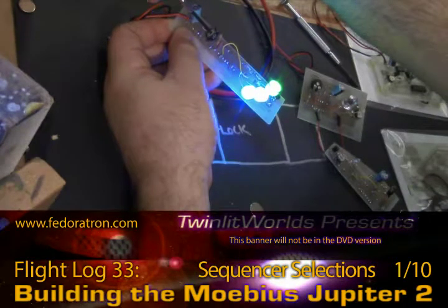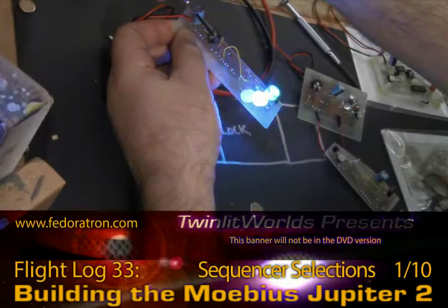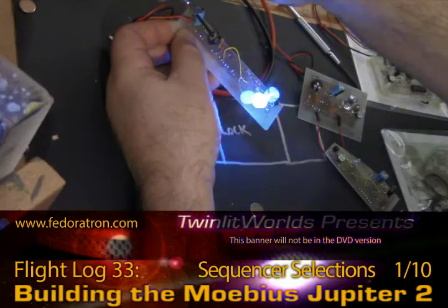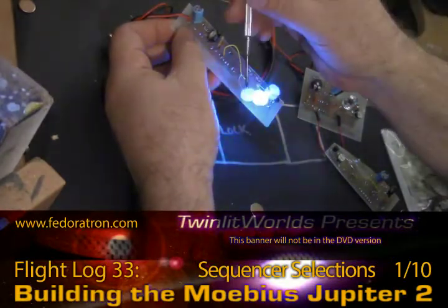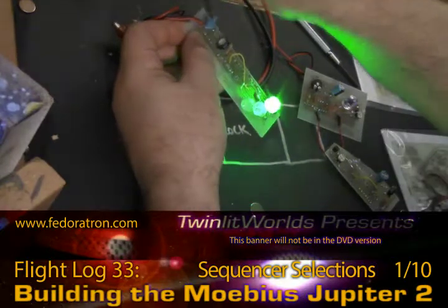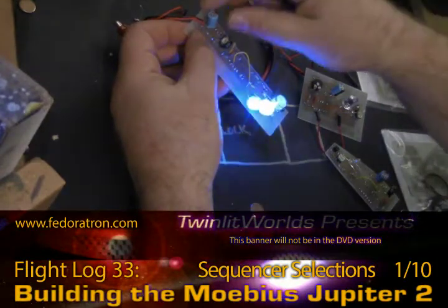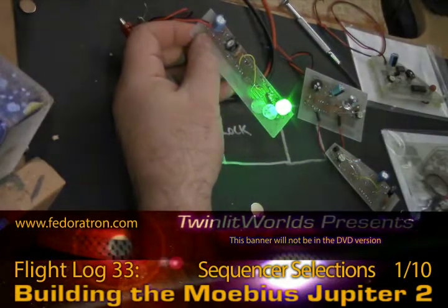It's actually pulsing right now — it's just pulsing so fast it can't be seen by the human eye, but the camera is probably getting something. With the slightest twist, we're down to that speed. The more LEDs you have in the sequence, the longer it's going to take to get back to the first one, which kind of extends its off time. The on time seems to be about two seconds. I don't know what you would change in here — probably the capacitor to store more energy, I would guess.